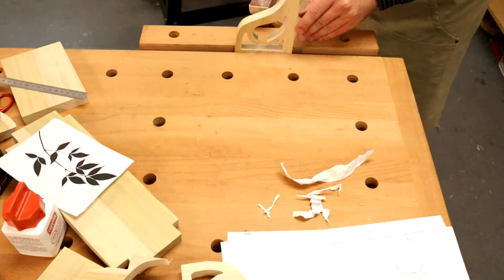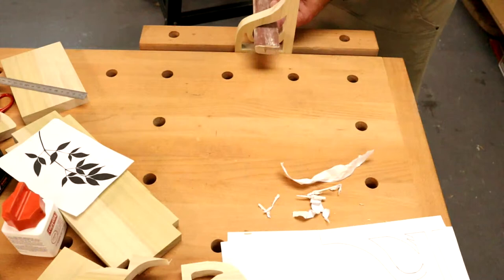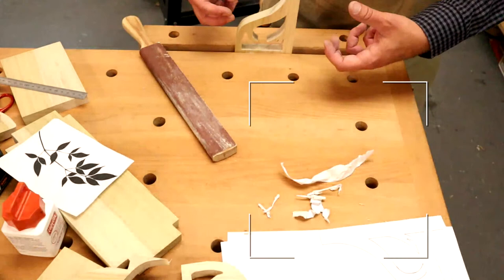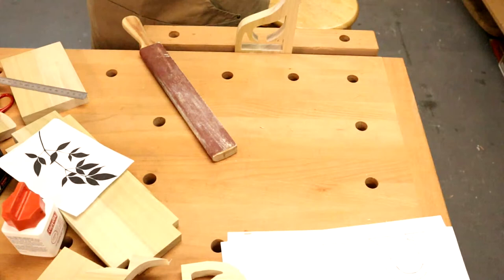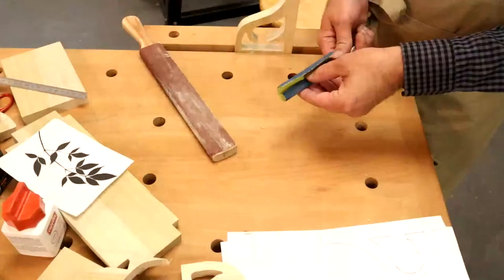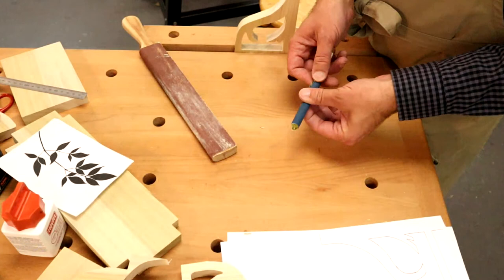These little abrasives, you can work them around those curves. Make things super neat and tidy. If you wanted to, you could round all of this off so it looks even more organic, even more of that round shape. What else could we use? We could use just a bit of cloth back abrasive wrapped around a pencil. That again is going to give you a nice curve to allow you into these tricky areas.